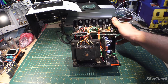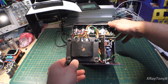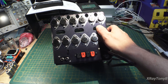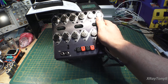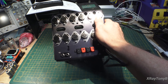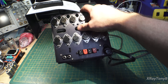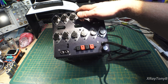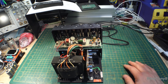Everything's put back together. This was a real bear getting these little tiny transistors back in here. On this side, I only used two transistor types for all of these — unlike the originals that had C2000, C3000, C4000 and all that stuff. I used the MJ21194 and MJ21193 for the NPNs and PNPs. They're very high power, high current 250 watt transistors. I think they'll work fine in all positions. It took me a real long time to put the smoke back in this thing — I hope it doesn't immediately let the smoke back out as soon as I plug it in.